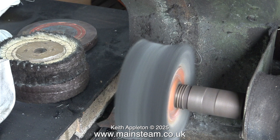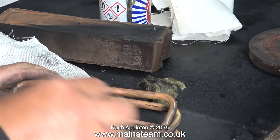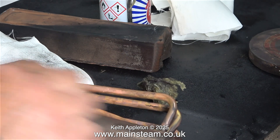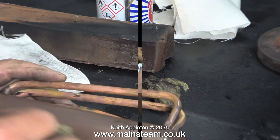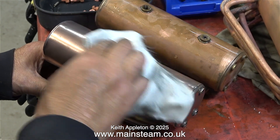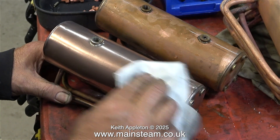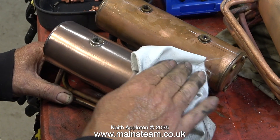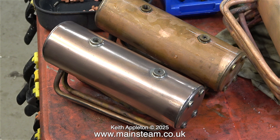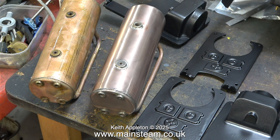You can clearly see the softer wheel flexes more and gets into the corners. The finish is not going to be perfect but when I was happy with it I finished it off by hand using Brasso Wadding. You can clearly see the difference between the 501 boiler barrel that's been polished and the one that hasn't. I'm actually doing the main polishing using a cotton cloth. This polishing is a little bit academic because when you steam the boiler it will go dull again very quickly, but I think it's worth it. You can see the difference between the two boilers.